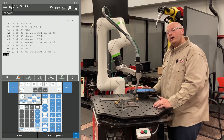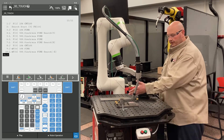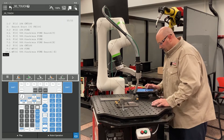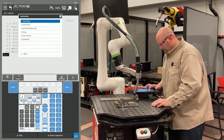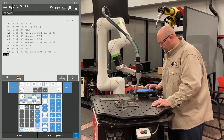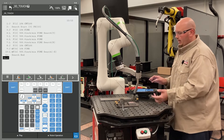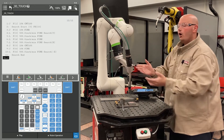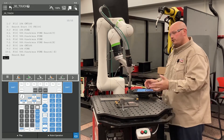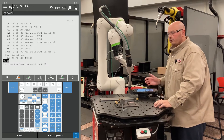A 3D touch requires one search in three different directions. We did that with X, Y, and Z. Now I'm going to tell the robot to stop searching: F1 instruction, go to touch sensor, search end. I'm going to record a point in space for my robot to pull up away from the part so it doesn't crash if I do any type of air movement. I'm going to record that with the F1 key.